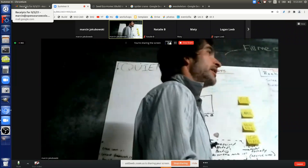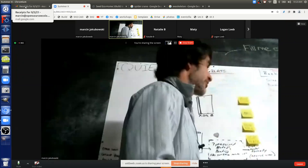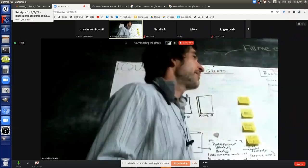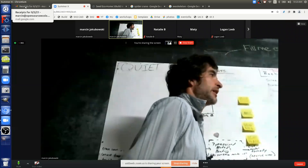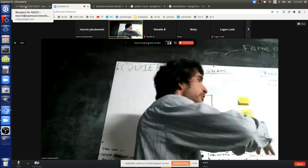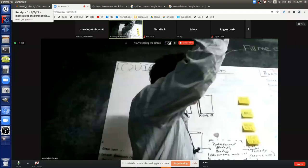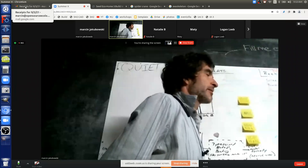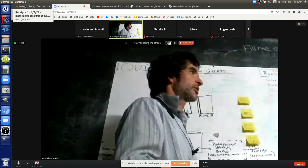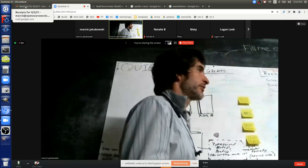So if we do that, then what do we do here? We've got walls, the top plate, then the second story floor. Basically, we're asking, what do we need here in order to make a complete building? On the second floor, we have joists, the plywood, definitely walls, roof structure. We don't need to do insulation there, since we have insulation in the other house. We can maybe do a sample. Here's what laying the insulation up looks like, both in the ceiling and in the walls. It's not too pleasant because it gets all over the place, but we can get a feeling for what that is.